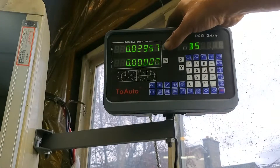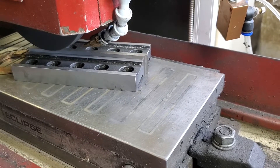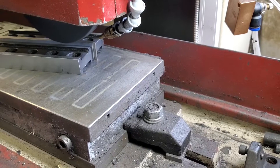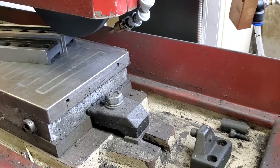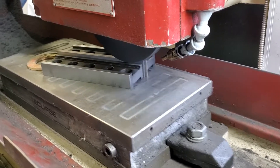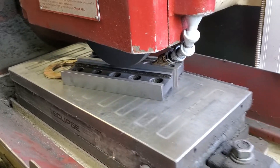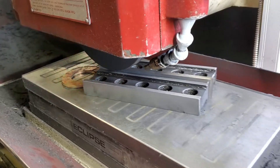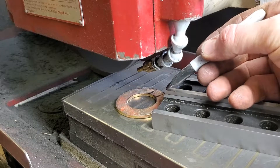Next, we're just going to zero our digital readout, then take a really fine pass across the top to make sure that nothing's out. I kind of usually hover just over the top — that way, if there's a stack of dirt or a hair or something like that, you'll start to see a bit of grinding. What I did notice was I had a bit of a banana shape in the metal — a little bit of heat distortion — and I was going to have to take that out. Turned out the distortion was only about a quarter of a thousandth of an inch. These aren't tool room parallels, and I'm really only shooting for maybe a quarter of a thou tolerance.